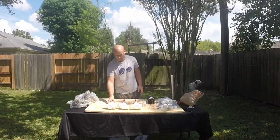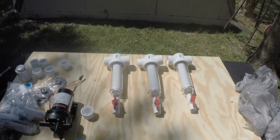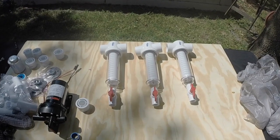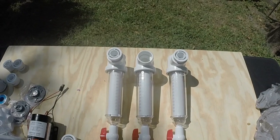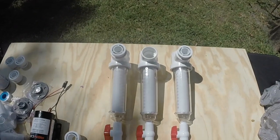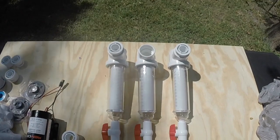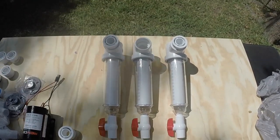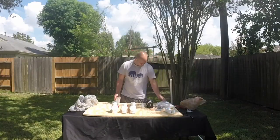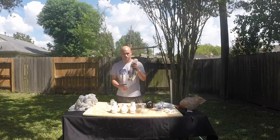Here's a quick look at what the three filters look like with the clean-out valves attached to them. The next step is to insert and glue reducers into your Rusco spin-down filters. This is a quick look at what the reducers look like in the filters. The middle one will have a reducer, but in this picture it's just to show you the difference of what it looks like with and without the reducer.